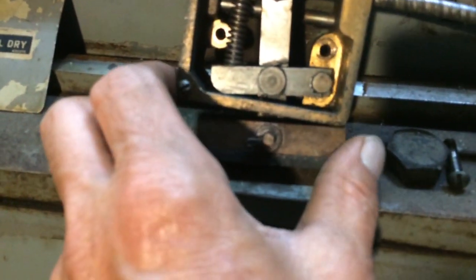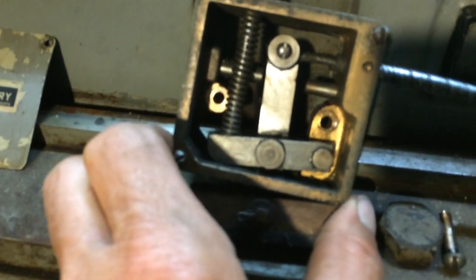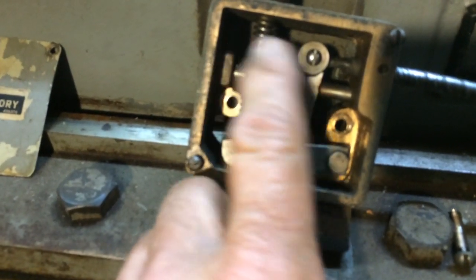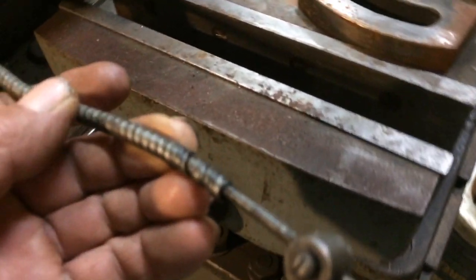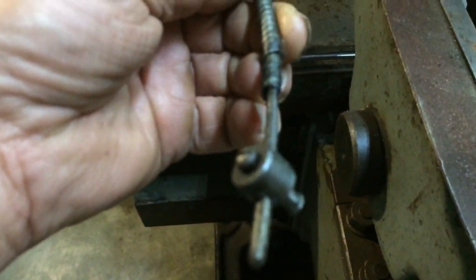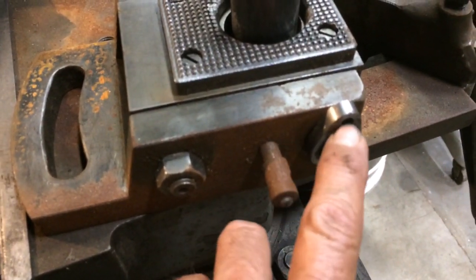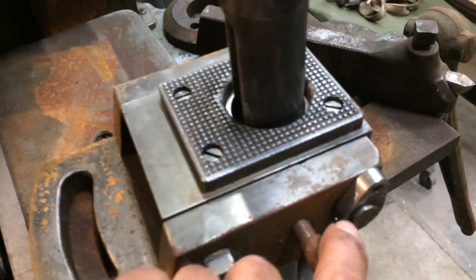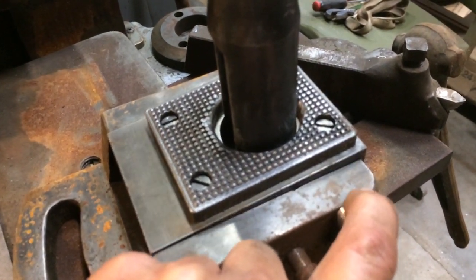As the shoe moves back and forth, you can see the little arm moves back and forth inside the thing up here. It just pulls the cable back and forth. At the other end of the cable, all we've got is a little pin-like thing, and the cable is clamped down in the clapper box right here and hooks to this little thing. As this little lever pulls back, you can see it raising and lowering the clapper box.